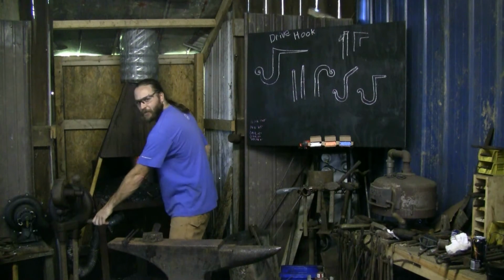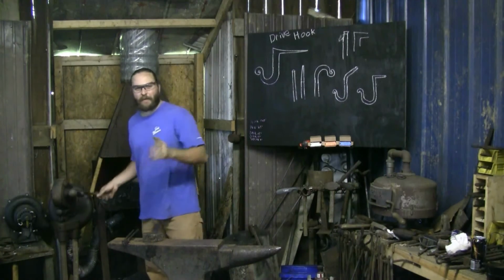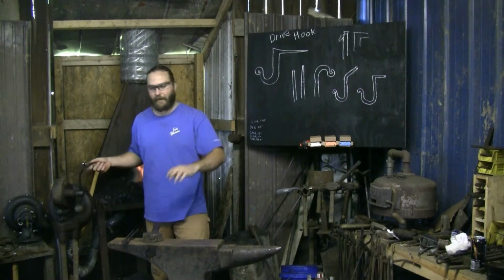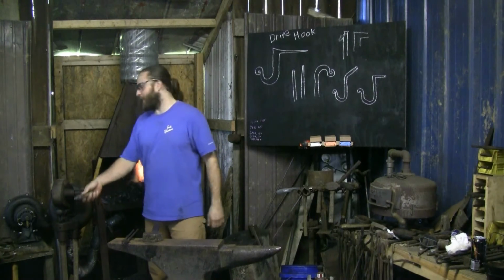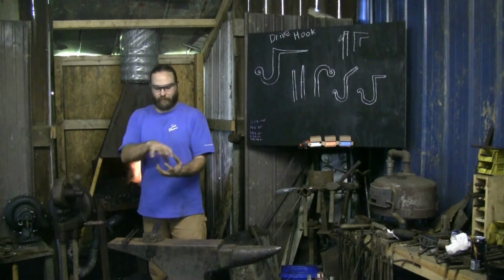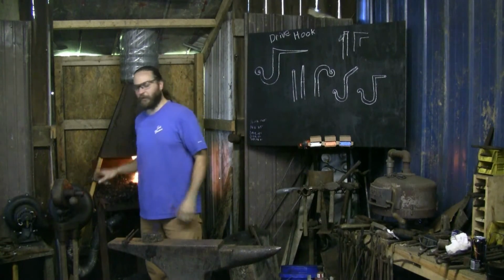I noticed you had a pretty shallow forge. I couldn't get a good look at it. I only watched the video once or twice, and I was looking more at the form and the hammering than the forge itself. But do try to make sure you have a base and you can get a nice mound going so you get some good concentrated heat.